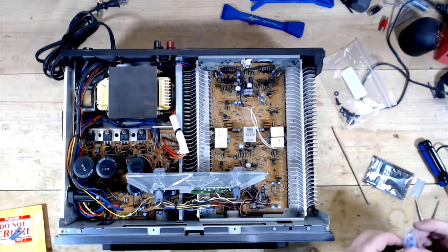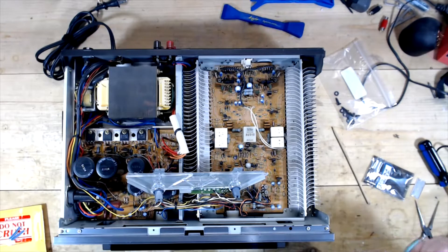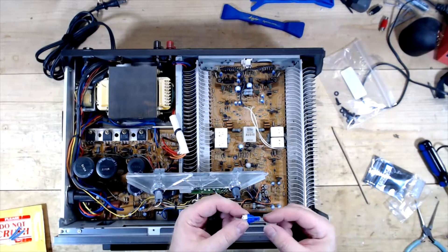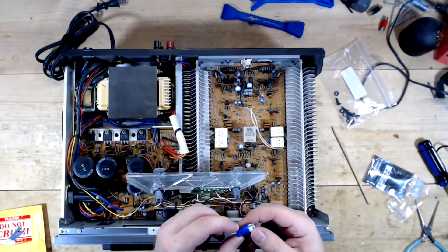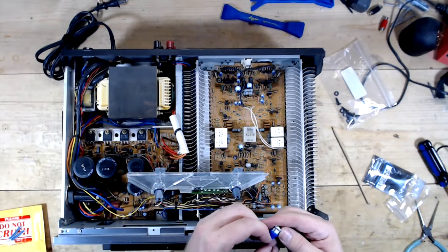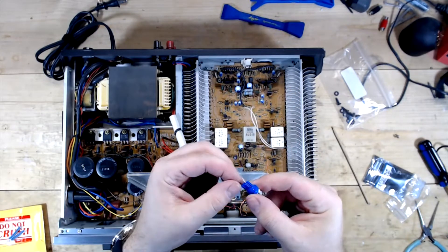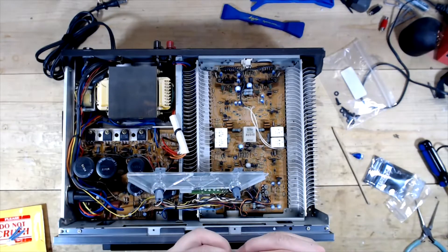Alright, so here are the new lamps. Couldn't get that bag open! So what I do is I bend these little tiny tabs — these little tiny wires — out, and I will solder them onto the existing wires, then shrink them after I'm done. I'm going to solder the two wires onto these ends, put some shrink on it, and call it good.